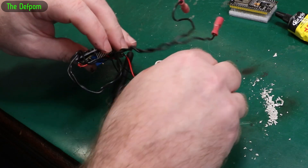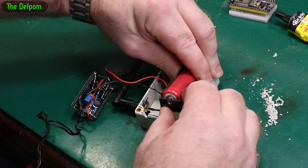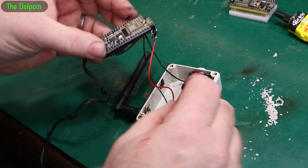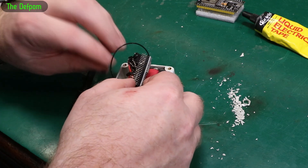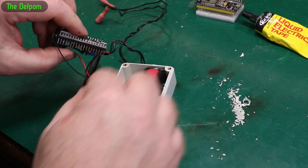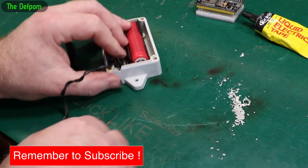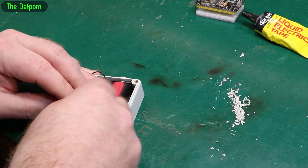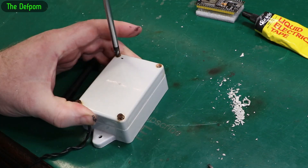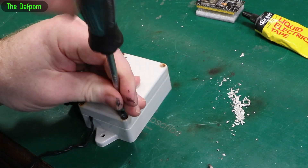This is ready to go together. The battery goes back in — this battery holder just barely fits in these boxes, it's really tight. The wires get pinched slightly at the end. I'll drop the board in and try not to pinch the RF coax wire too much — I'll coil up the spare wire in the bottom. The battery is at about 4 volts so this should last another year.